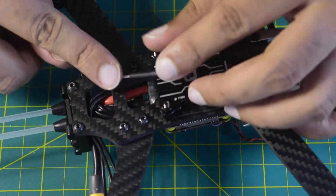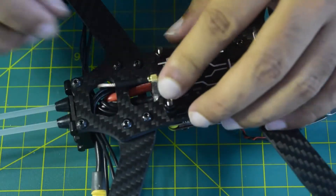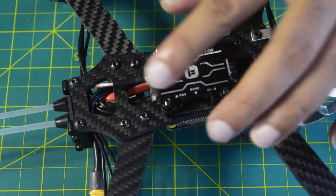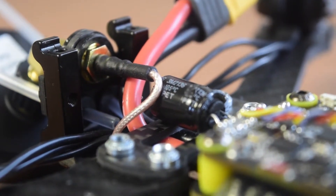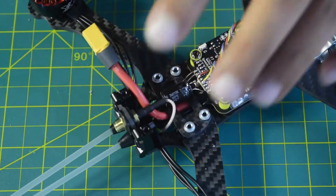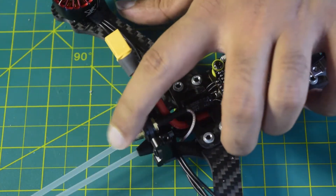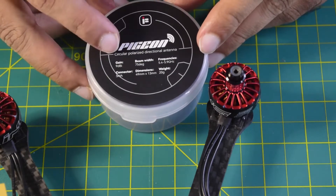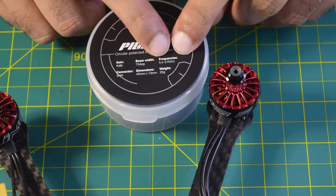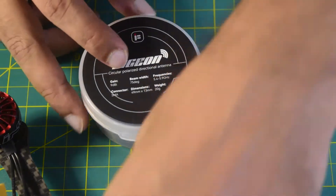Here I have put the VTX wire from the front onto the back, and now I am going to push it onto the connector on the side of the VTX. Now since I have connected the wire, let's install the antenna as well. As a word of caution, do not ever power your VTX without the antenna connected onto the junction — this will immediately damage your VTX. Ensure that whenever you power your VTX the antenna is properly installed. This is an iFlight 9 dBi gain 5.8 GHz circularly polarized antenna from iFlight.